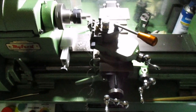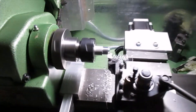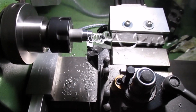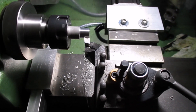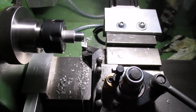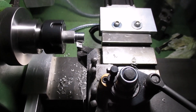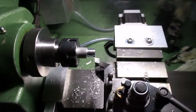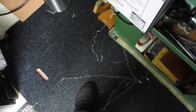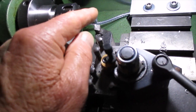If you stand back a little bit you might get a better view of the cut. It seems to be doing it quite nicely. I haven't got the speed too high — purposely, for the first test. And it should take the final cut off. You can alter the speed of the final cut so it can go slower or faster. So that seems to be successful. If you have a look, it's taken some quite long turnings off the aluminium. It feels very smooth actually.